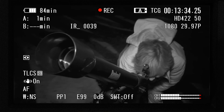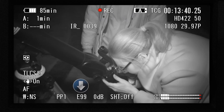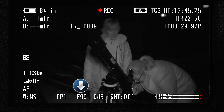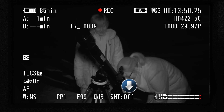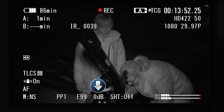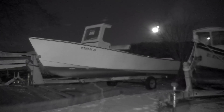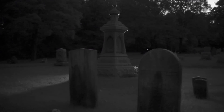That's a very important consideration because when you turn on Night Shot you'll have very little control over exposure on the camera. The iris is automatically open to its widest setting and there's no auto iris function at all. The shutter is automatically turned off and you can't change that either. The only thing you have control over is the gain. Watch what happens as I change the gain from 0 dB to 9 dB and 18 dB. But be careful — although it's helpful to be able to change the gain when needed, you'll want to use it sparingly because it does add unwanted noise to the image.